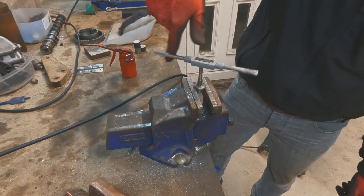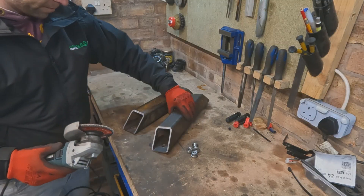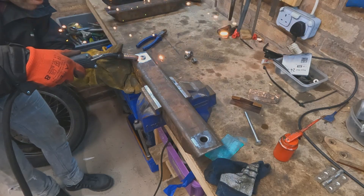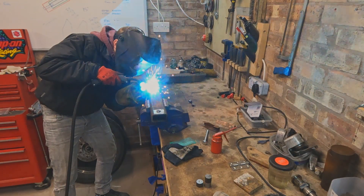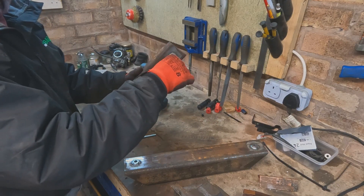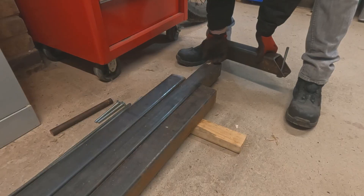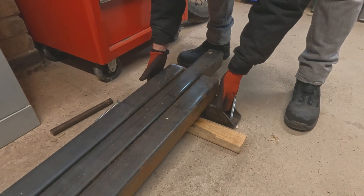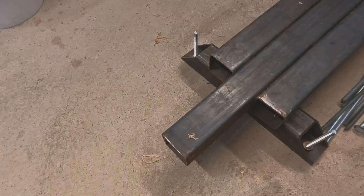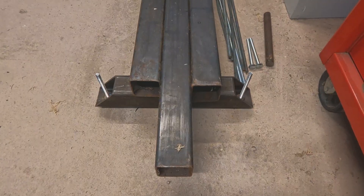So that is my parts for this section of the build — I've got my two pieces of box section and my four machined bosses. What I'm doing now is cleaning up the surface of the box section and then tacking the bosses in place just to hold them, and then I can continue welding those in place so they're nice and solid. You can see I'm putting the coach bolts in place — I am going to cut them down to make them a little bit smaller, but it's just to give you an idea as to how it's going to work. I'm possibly going to put some handles on them as well just to make it easier to turn or adjust them. They do have a square section towards the bottom of the coach bolt so I can adjust them with a spanner for the time being.